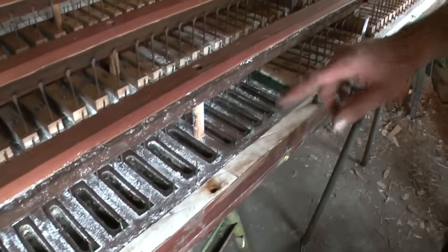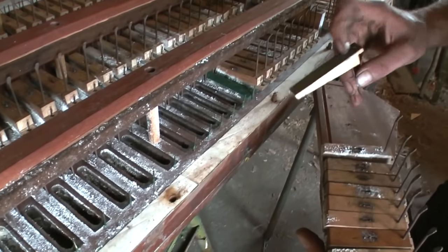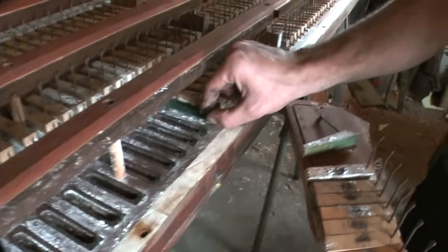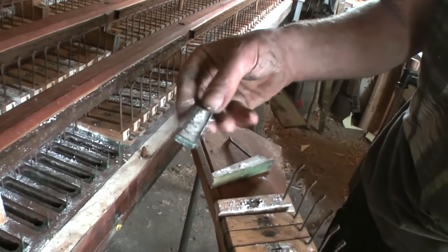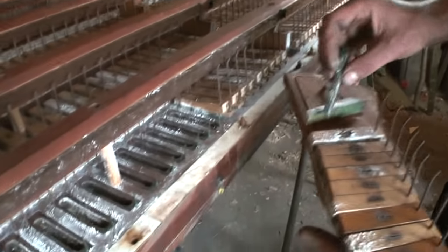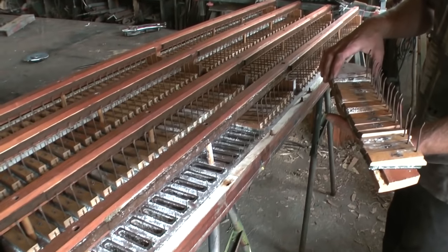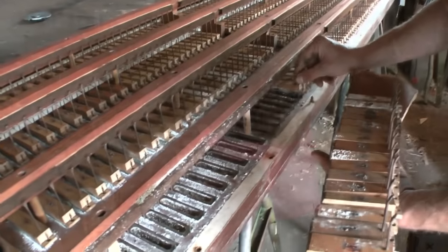You can see here where there's been water ingress. This particular pallet — and there were a couple of others — this would have been done with a water-based glue, like a sort of animal glue, and the pallet material has actually ended up stuck to the chest, so it's come unstuck. It's in good condition, not really bad, I don't think it needs re-leathering, but this definitely needs gluing back on, which makes us decide whether we're going to use animal glue again and go traditional, or whether we just go with the trusty Evo-Stik and have done with it. A little bit more work than we expected, but not horribly so.